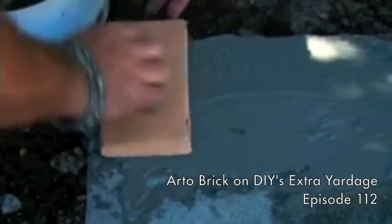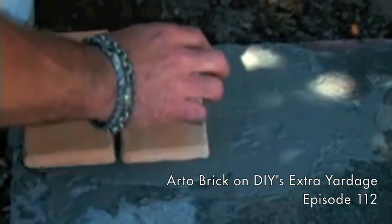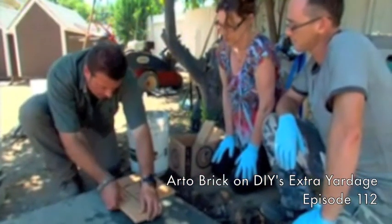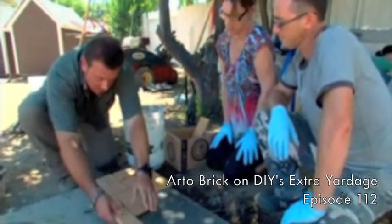We're going to border all along the edge, 3/8 inch or so. Don't worry about the gaps being perfect. Perpendicular to that border, we're going to run bricks this way. The second row will actually be a staggered joint. All right, let's do it.